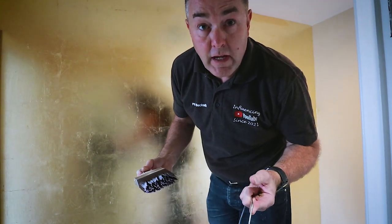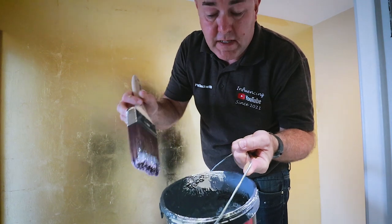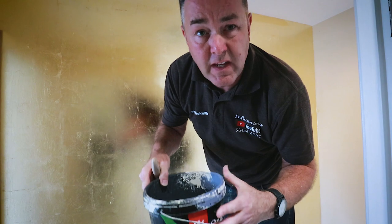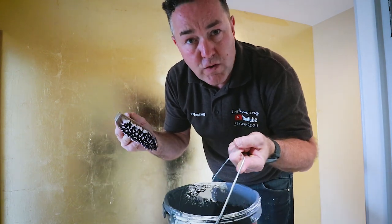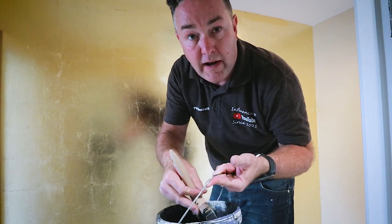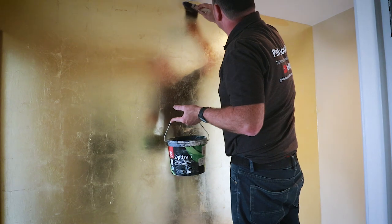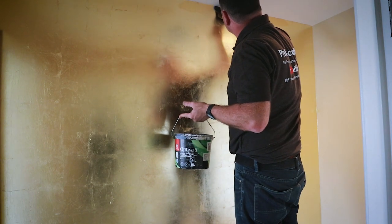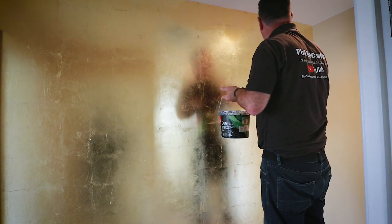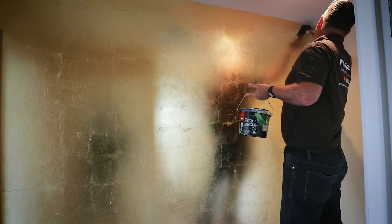Right, I'm going in for the coat of varnish now. Please work from one side of the kettle and no slapping it about. If you work from one side of the kettle, like you can see what I do here, keep yourself clean. Now, this feels quite thick as a varnish lacquer, but actually applying it, it goes on a dream. Don't worry if you just catch your emulsion ceiling and walls, because as I said, there might be a little bit of touching up later on.